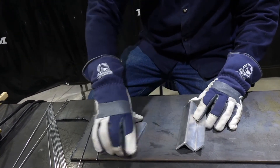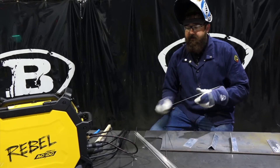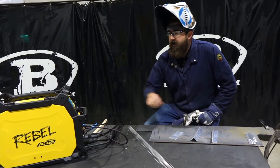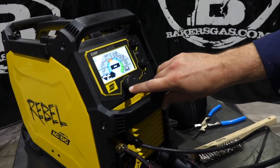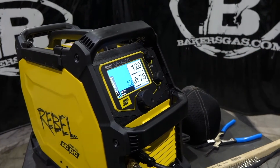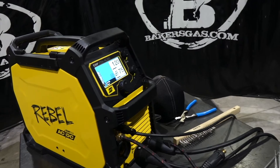We'll reverse one angle down and the other like this, with a little backer to hold the phone upright. We're always going to use a stainless steel brush on aluminum. I've got some aqua tech filler rod here. Flipping the machine on — for TIG welding, 100% argon, flow rate about 35 cubic feet per hour. Toggle from MIG over to AC TIG, confirm, and I've got it set at 120 amps and 75% balance — a good middle-of-the-road setting.